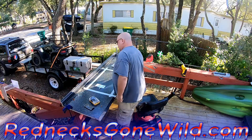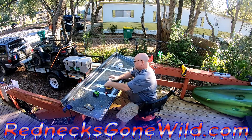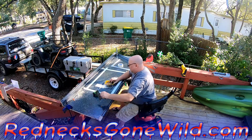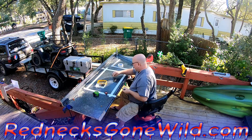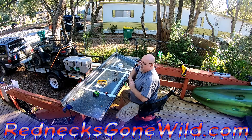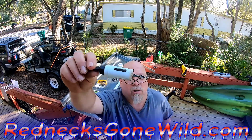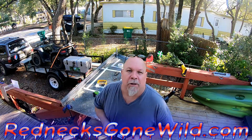What I do now folks — check this out. I'm gonna get a drill and drill this hole with what's called a hole saw — I'll show it to you real close in a minute. What you do with this thing is set it up with a one quarter inch drill bit right down the center, like I'm doing right now with an allen wrench. The allen wrench will hold the drill bit inside the middle of this saw, and that drill bit will guide it — it'll be a center guide so my hole is centered. You'll see what I'm talking about when I show it to you up close. This is my hole saw that I'm gonna use on all four corners so I can get my jigsaw started easily.